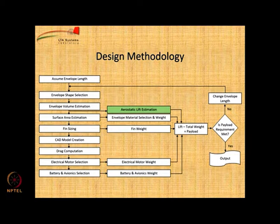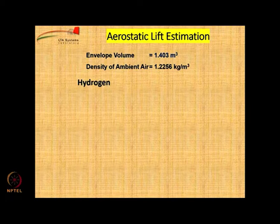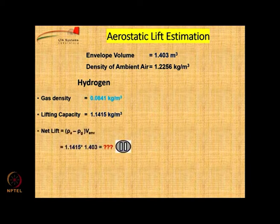Let us look at the aerostatic lift estimation. So, we have the envelope volume 1.403 cubic meters, we have the density of ambient air under ISA conditions. If we assume hydrogen as a lifting gas, we have the gas density under ISA conditions. So, therefore, the lifting capacity will be obtained directly by subtracting 1.2256 minus 0.0841, it will give you 1.1415. That means, for every cubic meter of hydrogen inside the balloon, you can get a vertical force of around 1 kg and 140 grams. So, can you calculate the net lift,